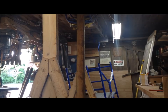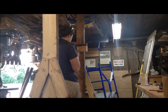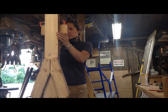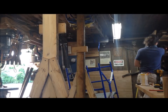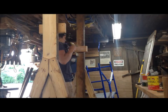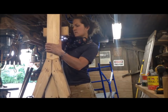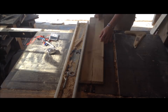I propped these up in my shop and found where I wanted that cross member to be to hold the bucket — that was based on the chair going underneath it. I found the measurement for the height of my head sitting in a chair and placed the bucket a little bit above that, so adults and children can fit in there. Then I leveled and screwed two little scrap pieces of two by four there so that when I take this apart and reassemble it, I can easily know where those pieces go — they sit on those two by fours and I can screw them in.